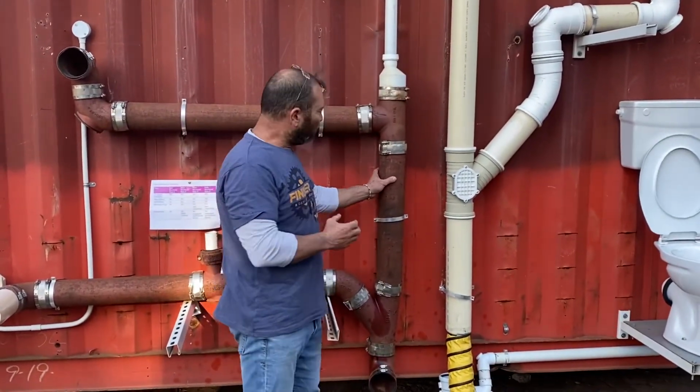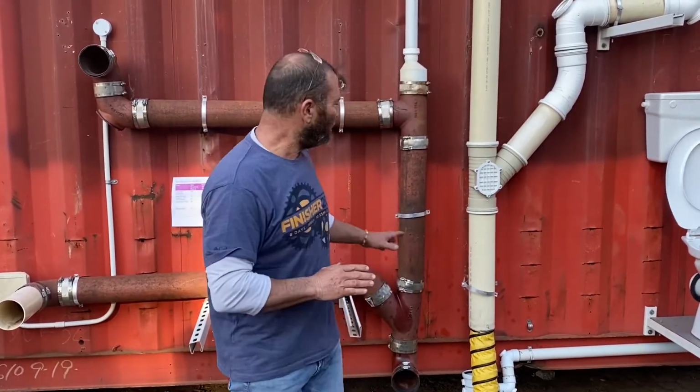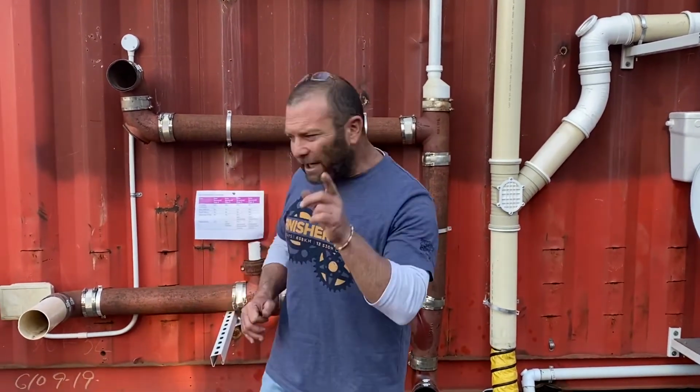do brush coating, if you're going to put a surface in here, whether you're going to brush the pipe with a resin or you're going to blow it, or however you're going to do it, with whatever rotating nozzle, whatever method you're going to use, you must, I'm begging you, please follow all the ASTM regulations. This has been going on for quite a few years now, and brush coating and spray lining of pipes is awesome, and there's a place for it. And let's just look at this